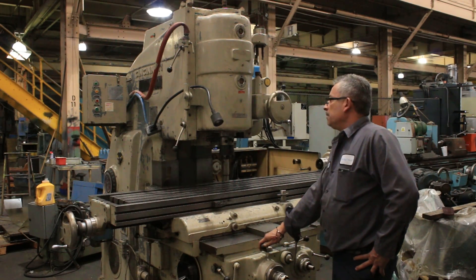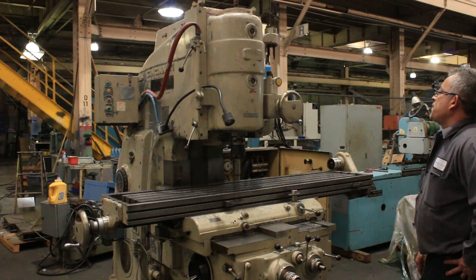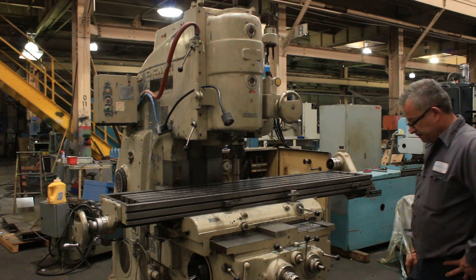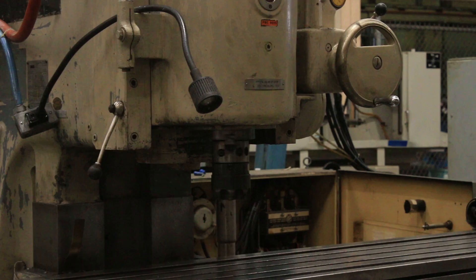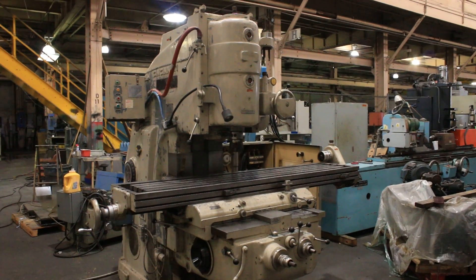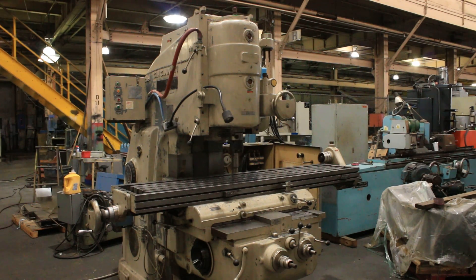It takes a moment to make the shift. There are 22 to 24 different spindle speeds and 32 different feed rates. Now you've made the shift to the lower speed — 43 RPM. So you've seen from 43 all the way up to a thousand RPM, different feed rates, and the machine rapid in all directions. Thank you for watching our video.